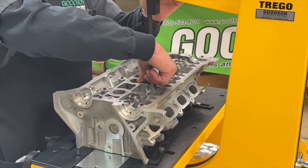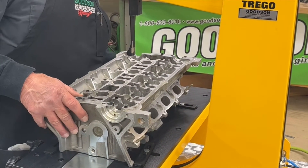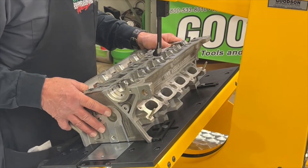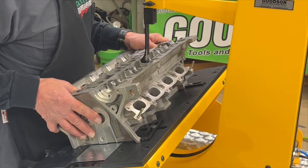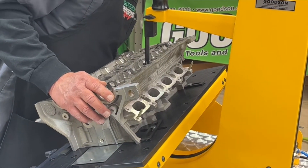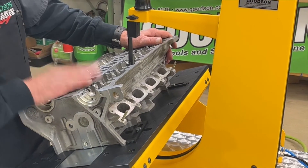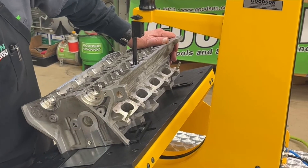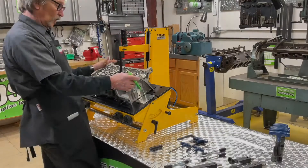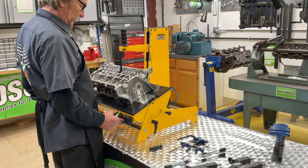So I want to figure out which valve I'm going to work on. I'm going to work on this particular valve on the intake side, so I'm going to loosen this up. I've got my cylinder head semi-secured at this point and I can go ahead and power my head down. Keep in mind, wherever you let off on pressure is where it'll stop. Go ahead and get your first one set up and then note where you're at. I'm right at 20 degrees on this limit. I'm going to tighten them up — and that's always good. I can know that on this five-valve head I can preset it. I can train the next employee running this machine that on this cylinder head in particular, 20 degrees is the angle to set up on the intake side so we can take these intakes apart or put them back together again. So I want to go back through and make sure that our outside is clamped correctly and our inside — the bottom rails — are clamped in that direction.